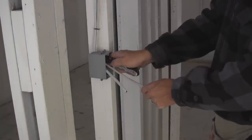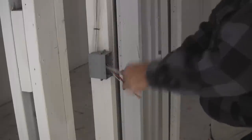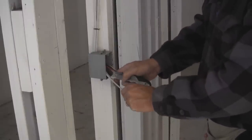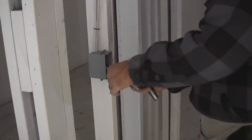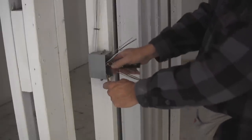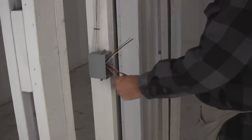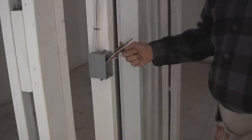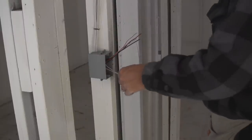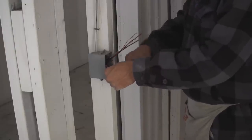On the other switch, I have the 14/3 coming down here — strip that down — and this is our switch leg. It will be the wire going up to the recessed cans. What we need to do is tie in the neutral, which is being carried over from the 14/3. We need to tie that in to the neutral going up to the recessed cans. I'll do that first while my mind's on it.